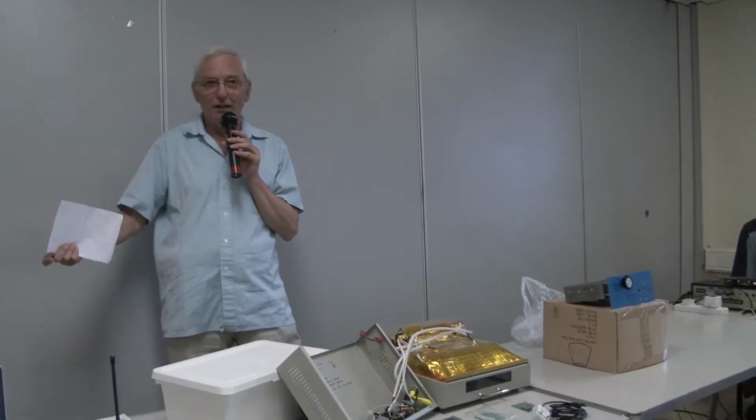Now this turns out the Swedish guys, whose name I've written down here, who put this stuff on Unified Engineering Sweden, what they discovered was that although there's two thermocouples in here, there's no cold reference junction for the thermocouples. That's a bit technical, but what that means is if you don't know what the cold end of your thermocouple is, e.g. the bit that you plug into your processor, there's no way you know what the hot end is. And they basically say it's going to be 25 degrees C. Well, it ain't, because when this gets running, the board's up at 40.